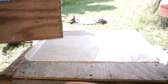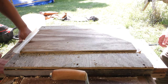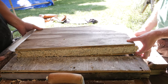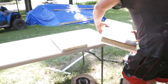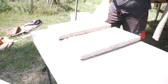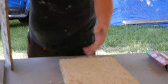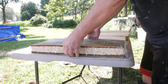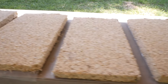Here are the transfer boards we made earlier. For this demonstration we only need five tiles, so we only have five transfer boards. On the count of three — one, two, three — nice and easy, we go up, go back down; grab the corner and slide it off to the side. Now we're going to carry this over to the table and flip it over onto the transfer board. Now we have a completed hempcrete tile: 12 inches wide, 20 inches long. In between the board and the tile is wax paper, and the board on the bottom is what you call a transfer plate. For every tile we make we need a transfer board.